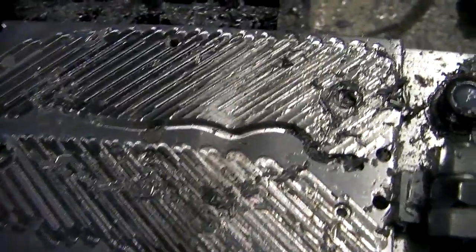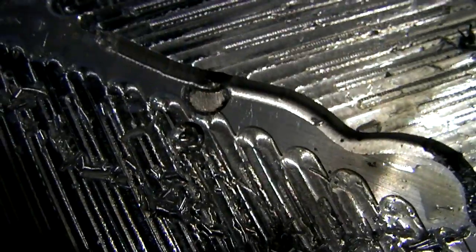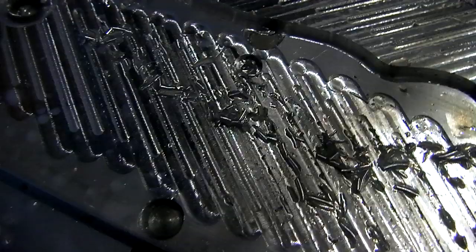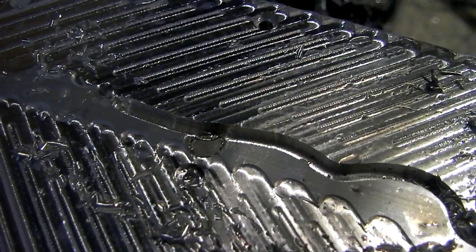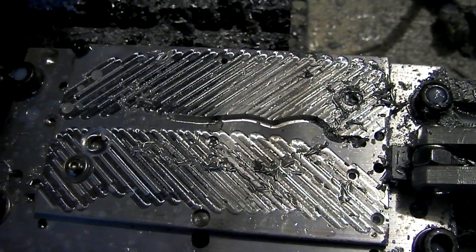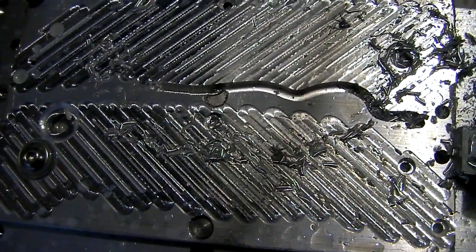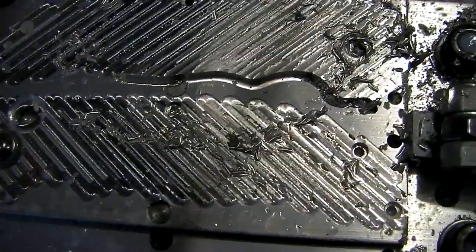Big surprise — made another mistake. You can see here I'm starting to profile around the outside, and remember those dowel pins we were talking about? Yeah, they sort of got in the way. Didn't see that coming. So of course it trashed my end mill — it started to make all kinds of funky noise so I stopped it. That's a bit of a pain, because now I have to restart halfway through a code, which is tricky but doable. I have to rewrite the code, or take out the pins, or something, so that doesn't happen again — because it's going to happen again.